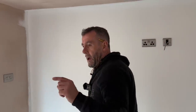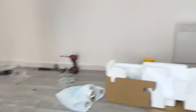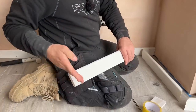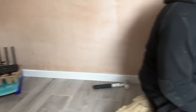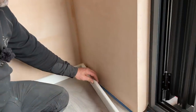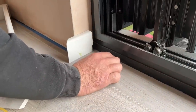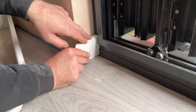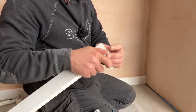A lot of people ask how we finish at the door. There'll be a bit of quad going on the front. The sequence was: back wall first — two square cuts; then the two side walls — scribe, square cut, then scribe to mitre. The scribe that goes into the square piece will look nice, and he's got a little mitre at the door. These have an upstand on the doors so they just need a little notch, but be careful to push it down enough. He'll magic mitre it, pin it, sand it, and John will fill it.